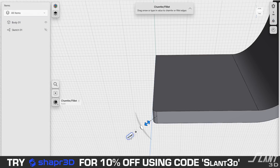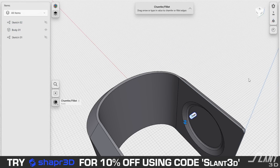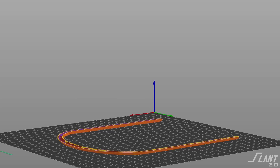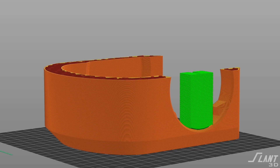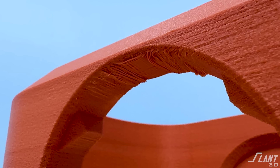In the bottom there are design accents — the beautiful curve and a detent in the bottom for the cup, which implies that's where you place your cup. Now, talking about the top: since this is being printed on its side, you have to be aware of the overhang. You don't want a saggy top and you don't want any support. With this first prototype, we actually have a rough side on top compared to the smoother side on the bottom. That's less than desirable but survivable for small-run products, and it can be addressed in post-processing. But if you're going for full print-on-demand, it is best to have design support inside there to make sure it's as tight and beautiful as possible.